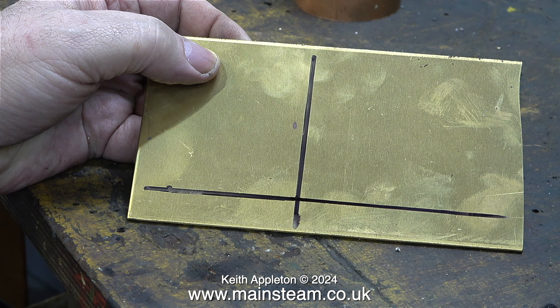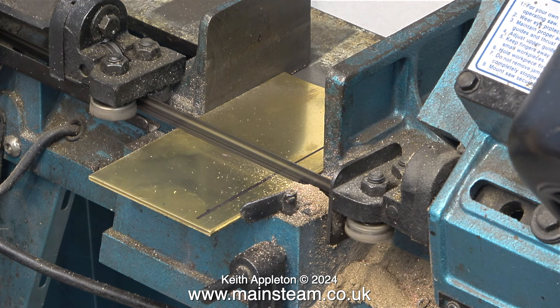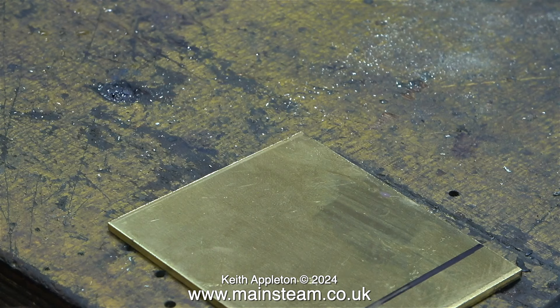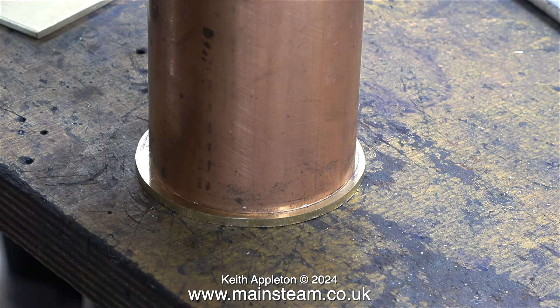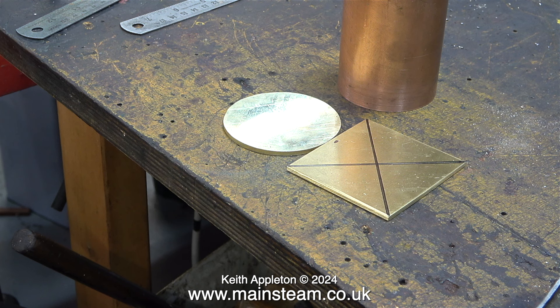Now it's time to make the base and cap for the condenser oil trap from a piece of 3mm brass. The first part of the job is to cut it in half. I tried the larger of my two bandsaws, which just took ages to cut the brass, so in the end I cut it on the smaller bandsaw — life is just too short to mess about. I ended up with two pieces: one cut square which will be the base, and one cut round which will eventually be the lid. This condenser is not a pressure vessel and it will be soft soldered together — no need to use silver solder here.